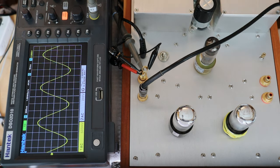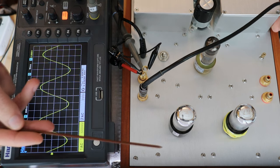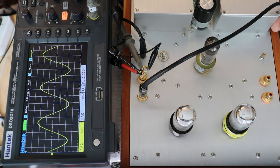Okay, so we've set up a little bit of a demo here with our original 6 or 12SL7 phono kit preamp. And we have, as Dad said, these rebased 7F7s that are in here. These are the old Sylvania back-to-back plate types. They sound absolutely amazing, but their noise floor is a little bit higher. And their microphonics are a little bit higher.